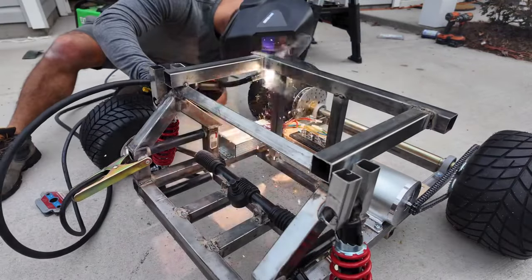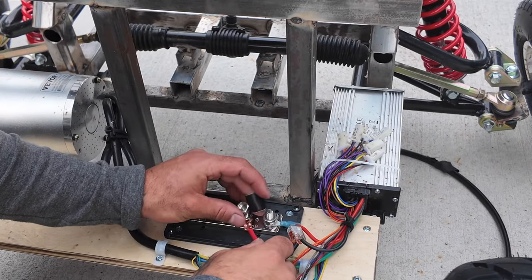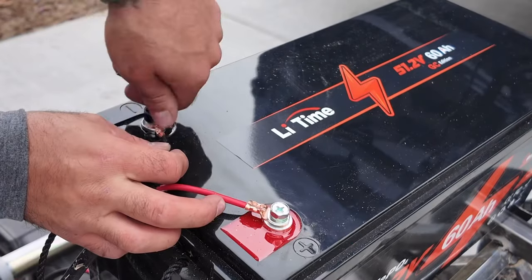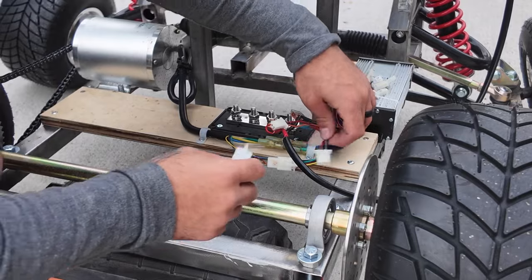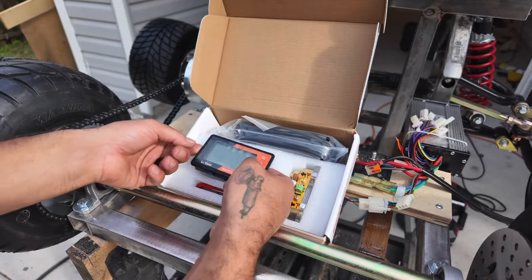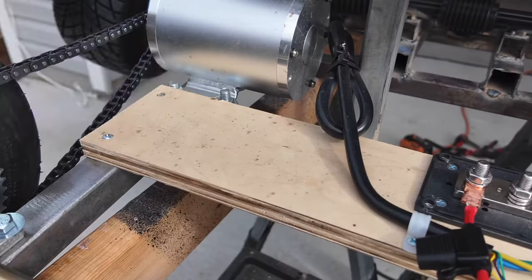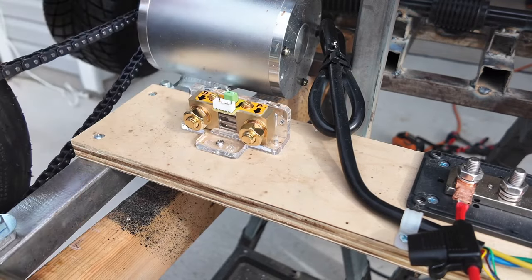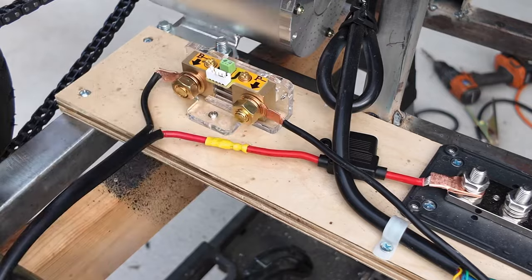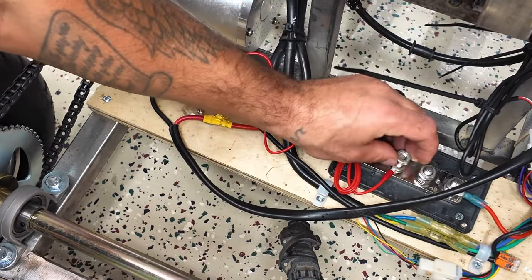Now that the battery mount is all welded together, it was time to install the 60 amp-hour lithium battery that Leetime sent us. This is not a paid sponsorship — Leetime sends us their batteries for an honest review, and after using their products in multiple builds, they're our go-to company because they make quality products at a reasonable price. We then installed the fuse onto the bus bar, then started to install the shunt, which measures the voltage in and out of the battery and displays that information on the battery monitor screen.